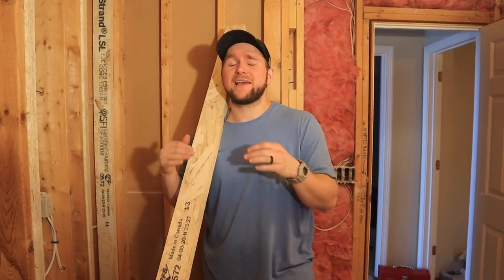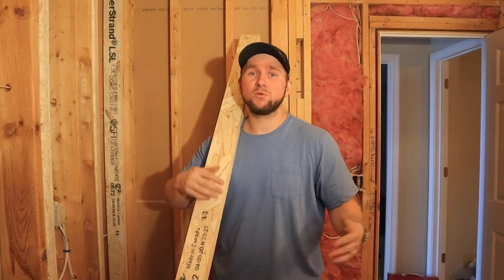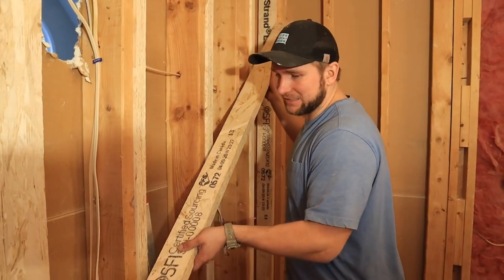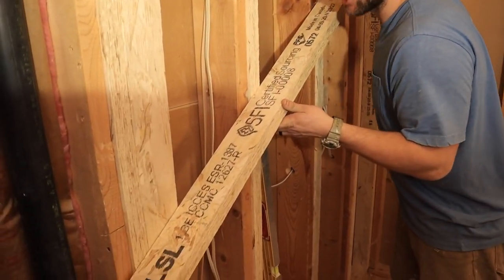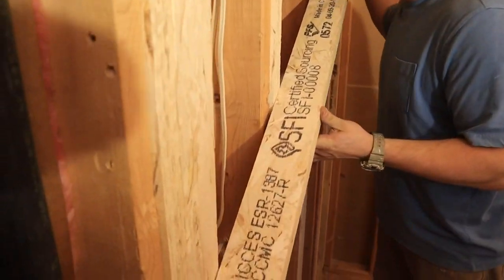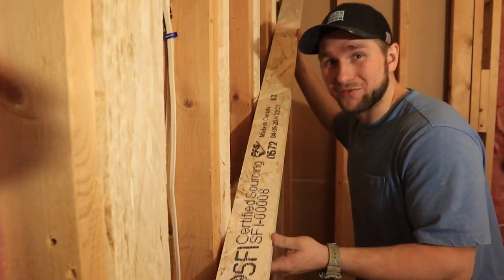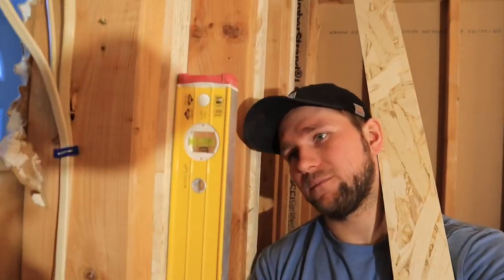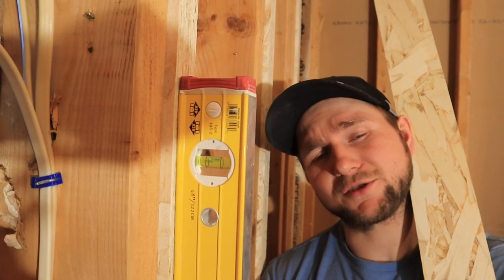All right guys, and that's it — that's how you get your walls perfectly flat and plumb. Flat is important for tiling because if it's nice and flat, tiling goes so easy — you don't have to worry about any lippage, you just trowel and stick the tile on. You want it to be level too because we have glass panels and glass doors, and we're trying to be legit contractors. So these are LSL studs, laser cut — we have absolute contact with every single stud, so that's perfectly flat. Please subscribe for more stuff like this. Tomorrow I'm going to show you how to build a niche.